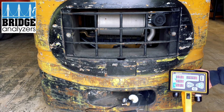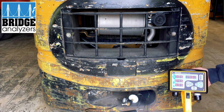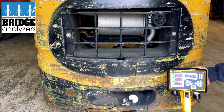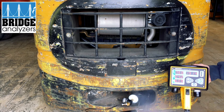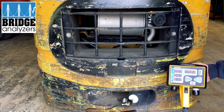Now we're at about eight percent carbon monoxide, which is why we have the door open — this is a very old lift truck. CO2 is about 4.3 to 4.4 percent, oxygen is running about six percent, and the hydrocarbon is about 1500 ppm.